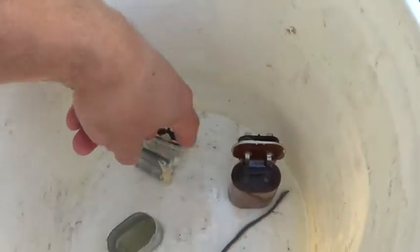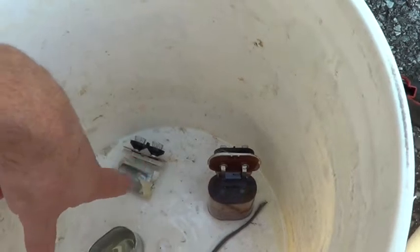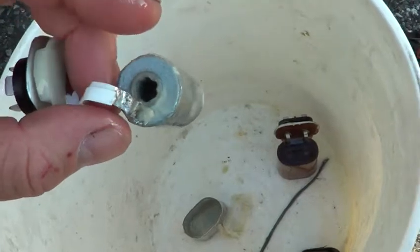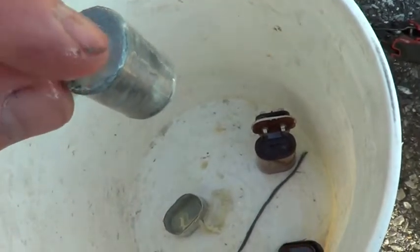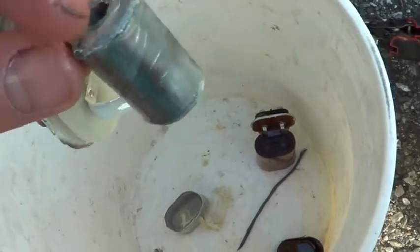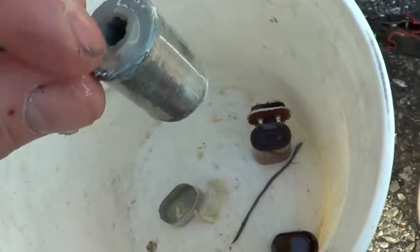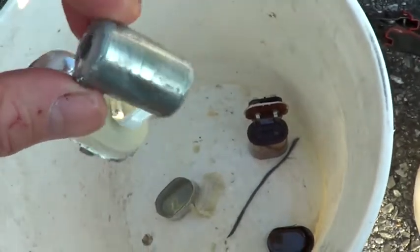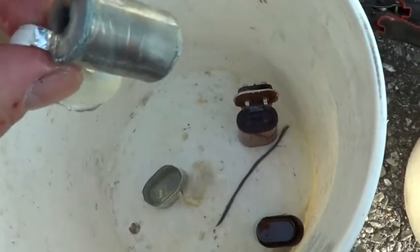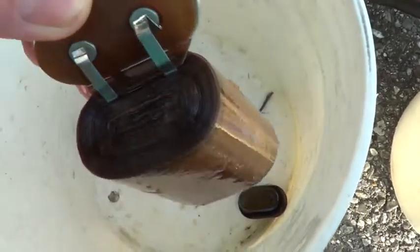I think what's failing in these new ones is the insulators are breaking down. On the new one you can see how that tin is sprayed — it's not molten, it's sprayed, which means it's molten without getting hot — and it welds all the plates together. Then they just solder with a soldering iron right to the tin, so you get a solid connection that hooks the plate in parallel, versus having to run to the end of the plate with the old design.